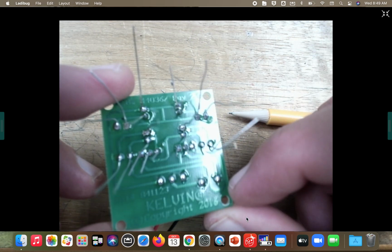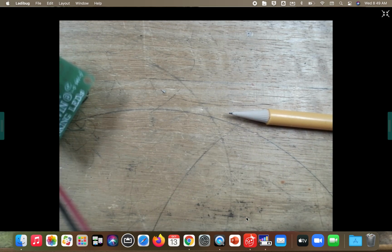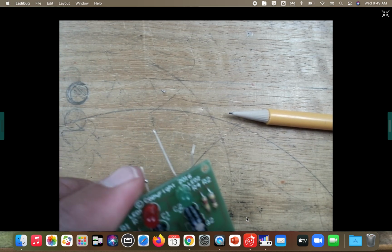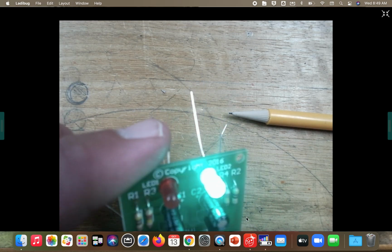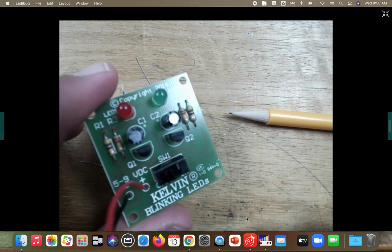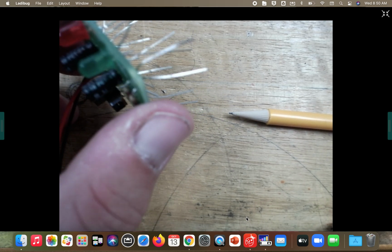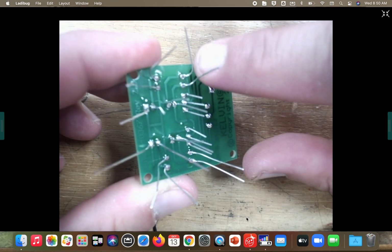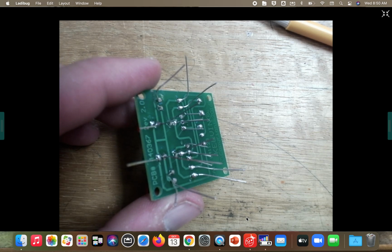All right, now, guys, once you get all the legs separated out and stood up, we can grab a 9-volt battery up here at my desk. Make sure you match up the plugs. It should not be on when you first start. You should turn the switch, and then they will flash back and forth from red to green. Hang on. Now, once I know it's working properly, I'm going to shut it off, disconnect it from the 9-volt battery clip, and then I want to go to the back over there and do this over a trash can. We don't need to save any of these legs. And I want to very carefully trim off all of my legs right next to the welds. Got it? All right, test it out. Make sure it's working first.